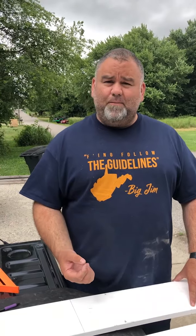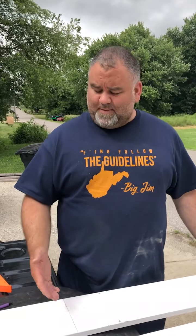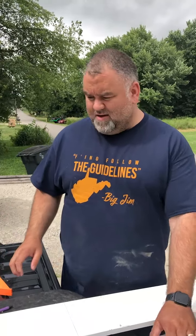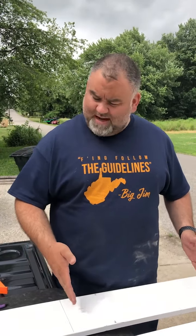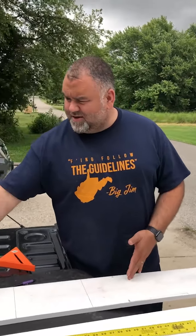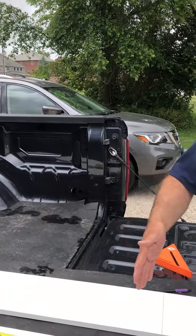The problem is on the very front there's a lip where the front portion of the cabinet mounts to the E-Pro itself. So it's about 8.5 inches and I've got an 8-inch board which actually measures about 7.5 inches total. We bought some pre-primed pine that we'll paint later. We're going to make two side boards — 43 inches on each end — so I can use the manufacturer cut on both sides.